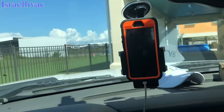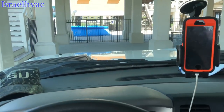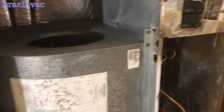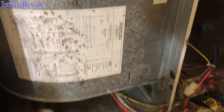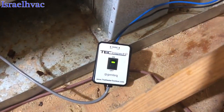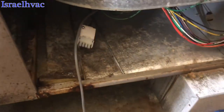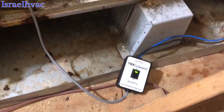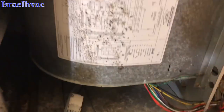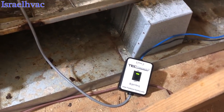We're going to go in here and get in the attic and see which one it is. There's our Carrier air handler. It's a foam house, but it's still hot as hell up here. I've got my motor tester plugged in, grabbing red and common. It's on. The motor's not coming on, which means we have a bad blower motor.